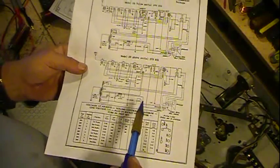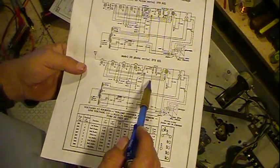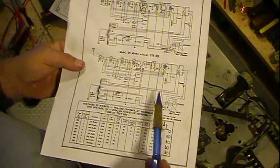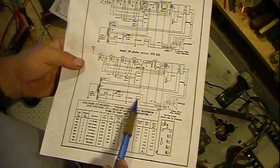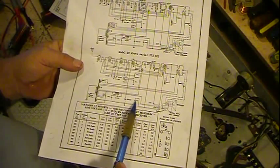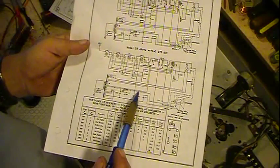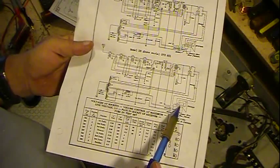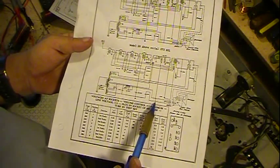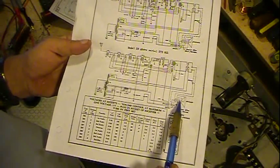The first thought you may have when you first look at this, especially if you're a newbie, is you might think, oh, wait a minute, that's a negative voltage up there, or it's ground or something. That's not B+. Why are they doing that? It's this capacitor right here you want to look at. That blocks everything, DC wise. That's just another one of the filters. Really what's going on here is that's actually just going to ground. How B+ runs is it comes down through here and goes through the field winding and comes back, still B+, but better filtered, and then goes up. This capacitor happens to be just another part of that filter, just on the other side.